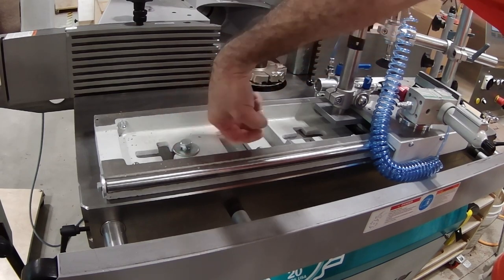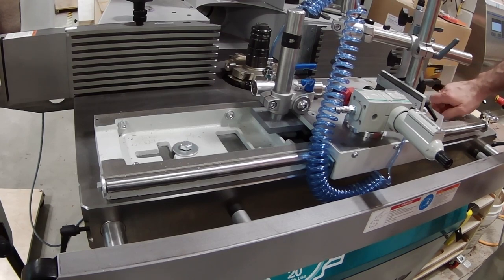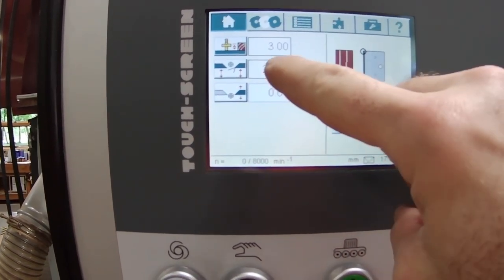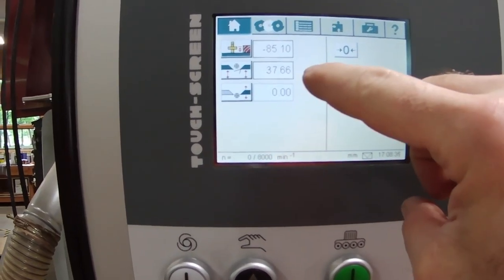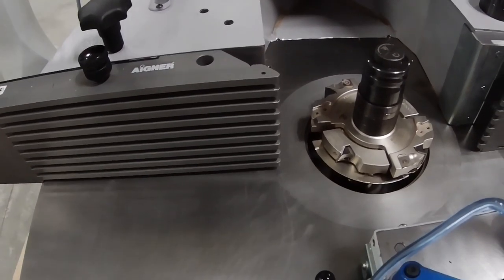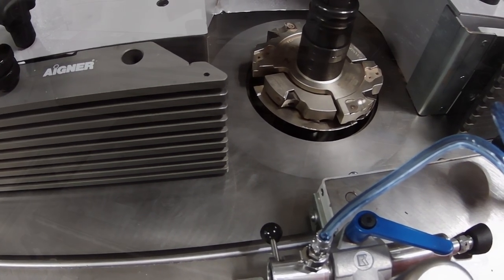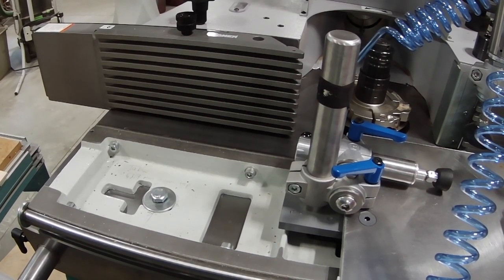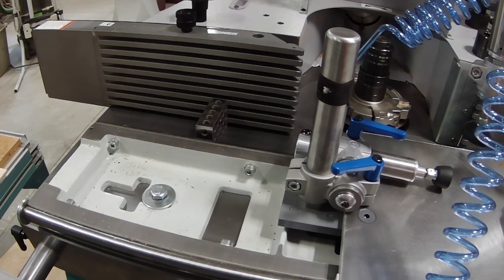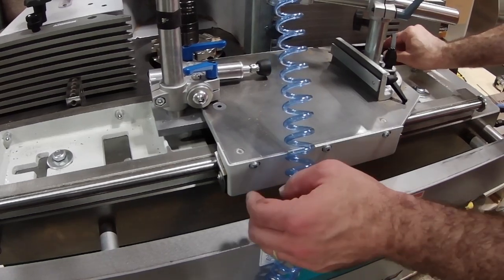I do this with one-two-three setup blocks referencing the face of the shaper fences. The first thing I do is pull the faces forward so the blocks have a spot to register. On the shaper control panel, I touch the fence position and type in 114 millimeters, setting the fence to where it needs to be to register the blocks. On the Martin shaper, holding down the power button activates the program — in this case moving the fence forward to 114 millimeters. With the sled still loose, I put the one-two-three blocks down, ensure the fences are snug, and tweak the whole sled up against the blocks to ensure they are exactly three inches and parallel to the faces of the fences.